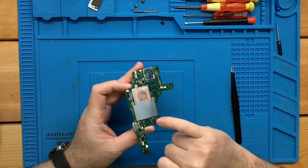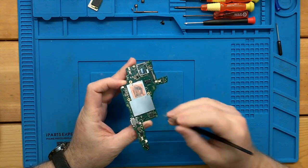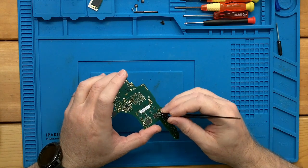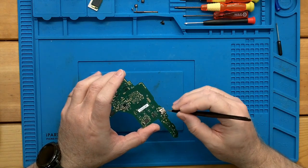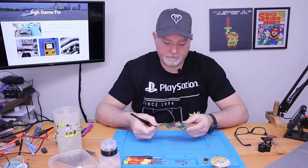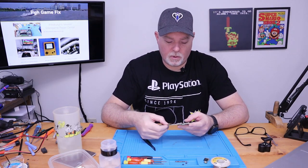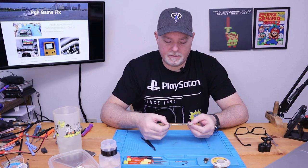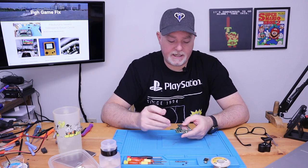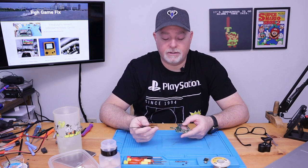Normally whenever I work on these boards, like if I'm changing our charge control chips and our charge director and your video HDMI, USB controller and a few other things, I'll use my heat gun and I'll just put it right on it and we'll heat up that part of the board. And it usually works out fine. The problem is with this plastic, if we use that heat gun and start trying to heat these solder joints, we're just going to melt the connectors.